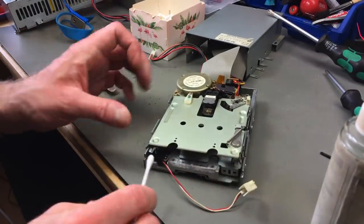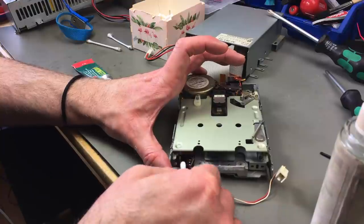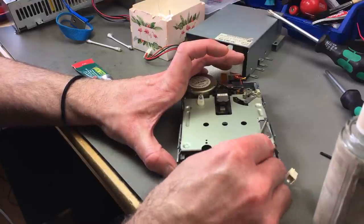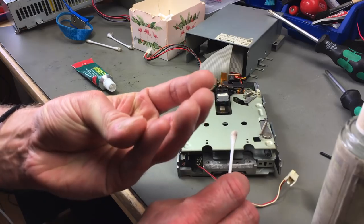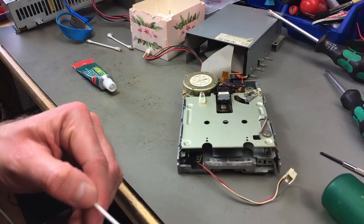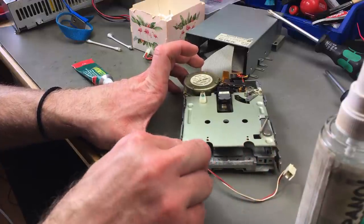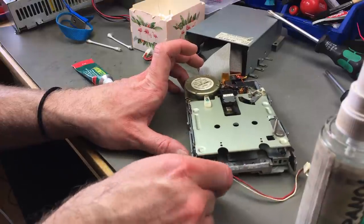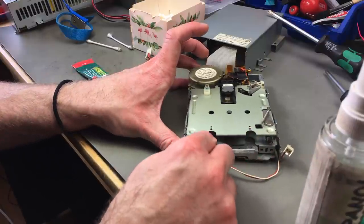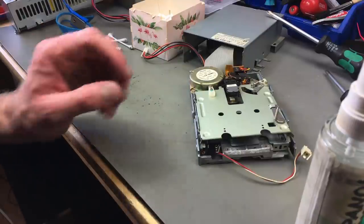Also, you shouldn't blow into cartridges. I actually had a discussion with somebody about that and he said, yeah, it's fine. And I've seen cartridges like NES, Super Nintendo, Mega Drive, Master System cartridges, that if they are not making good contact, people used to blow into the contacts. That way you're introducing a lot of moisture into those. And moisture causes a lot of corrosion. I've seen cartridges that were not working anymore because they were so corroded from the moisture that had accumulated inside over the years. That's not desirable. It's also not nice to clean them.